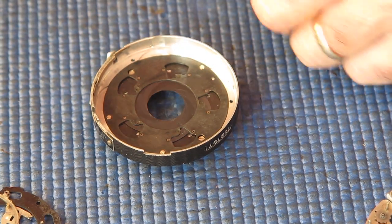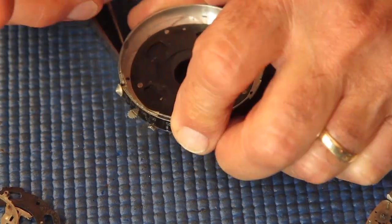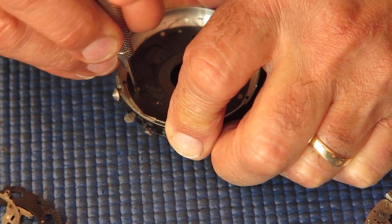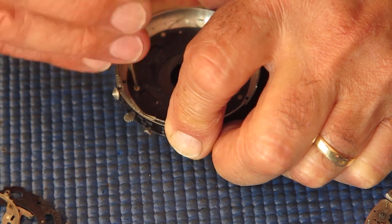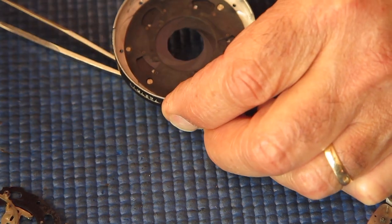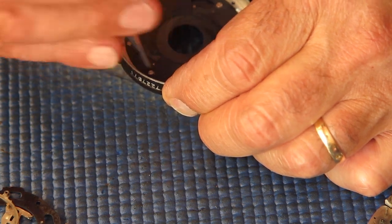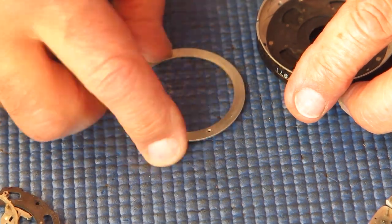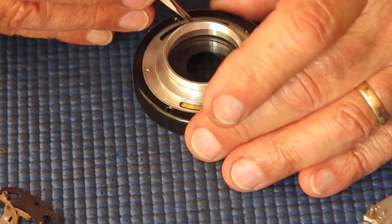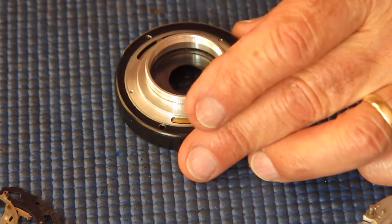It's quite reluctant to unscrew. It suggests that it might be riveted over to some extent on the other side. I'm supporting that plate on a pair of tweezers there, so I've got to apply a fair bit of downward pressure to that screw to make sure the screwdriver doesn't cam out. And the same on this one. Yeah, the lever falls away. There's nothing obvious about it. It doesn't look like those screws have been riveted over to any extent. I think they were just screwed in tight, and they may just possibly have a hint of corrosion which has helped lock them in place.